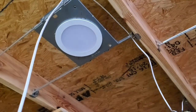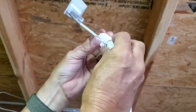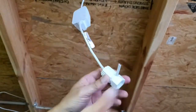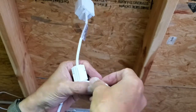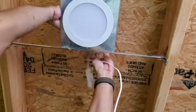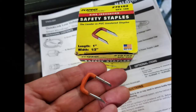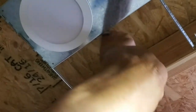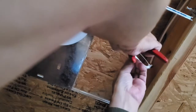I'll be using all 35 feet of the cable, so the end of the cable will need to be terminated or covered to protect the exposed wires. The protective cover is supplied in the kit, but make sure you leave yourself enough room on the end to insert the wire into the protective cover and clamp it down. Now all of my lamps have been installed and the low-voltage wire has been attached to each one. We need to clean up the loose wires, and we'll be using safety staples to do that. I was careful not to hit the wires while hammering the staple in. Next, I used tie wraps to pull my loose wires together — it's not really necessary, but it does make the installation look a little cleaner.